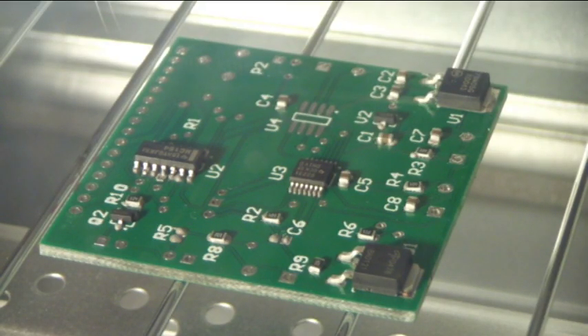Our board is inside the oven. On the pads of the board we have placed something called solder paste, and on top of the solder paste we have our components. Solder paste is actually tiny particles of solder suspended in flux. When it heats up to the point where normal solder would melt, the solder combines together and separates from the flux, forming a solid connection. Once it cools down it will be just the same as a regular hand-soldered connection. In a moment you should see the parts flow on the board — hence our reflow oven.